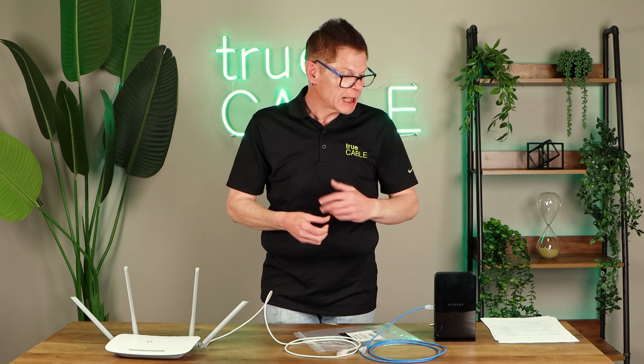The patch cord is a critical component. If you have something in the chain between your cable modem and your gaming console that isn't giving you the best possible performance or is dropping packets, a lot of home equipment won't even tell you there's a problem. It will simply try to establish the best connection it can and might establish a so-called gigabit connection — but it's not telling you about the roughly 200 packets out of every thousand that it's dropping to maintain that gigabit connection. You need more enterprise-level equipment to even determine if you're having a patch cord problem with packet drops. That's why you want to opt for cables that have been thoroughly component-rated to the CAT6 standard and certified — so you don't have to guess.